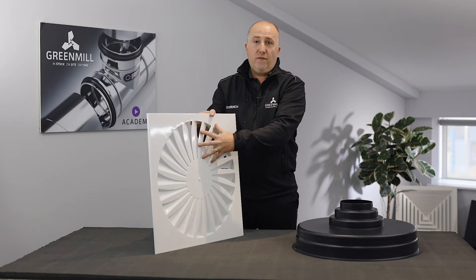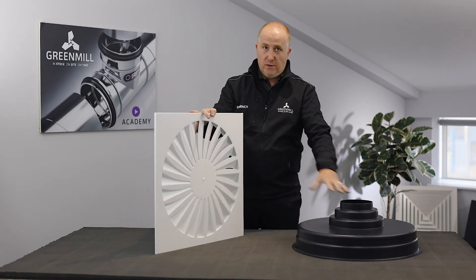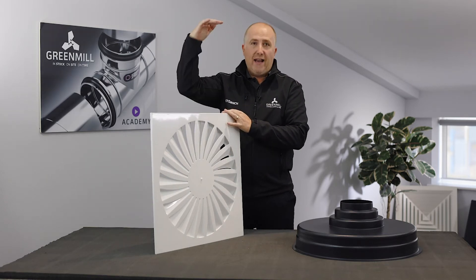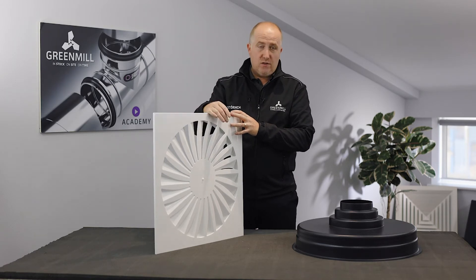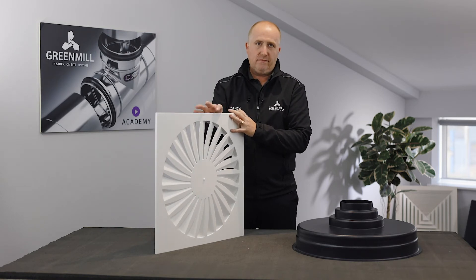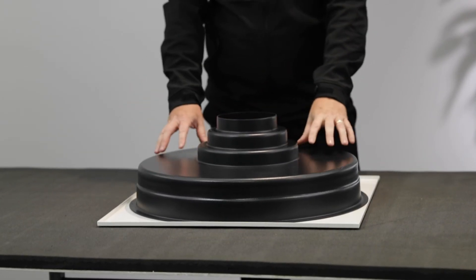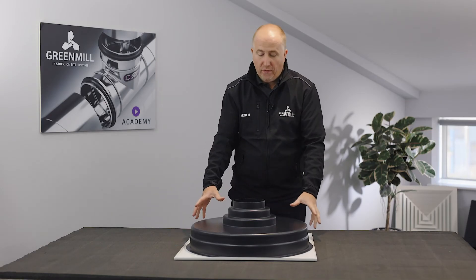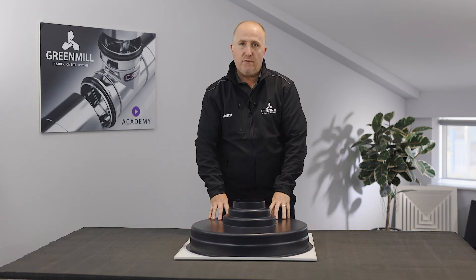A unique feature on this grill is that with the circular grill and the circular plenum, it would create a swirl of air coming out evenly at higher level. What people have said in the past is where they've had a grill above their office or their desk, you don't get to feel that on the back of your neck. This plenum fits very nicely onto the back of the swirl, which complement each other very nicely and you get a smooth flow of air. I have seen plenums before on these style grills that are square — not quite as good for the airflow as the circular.